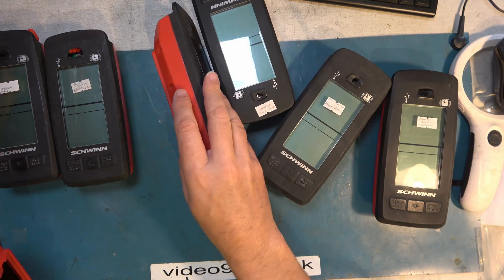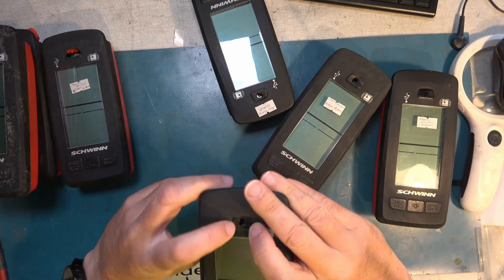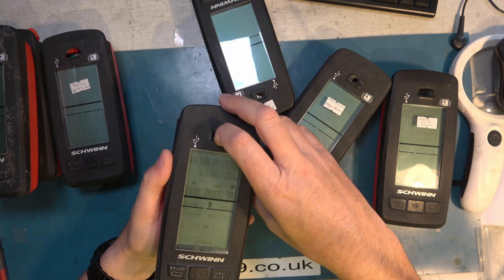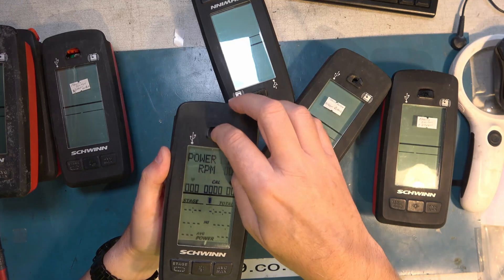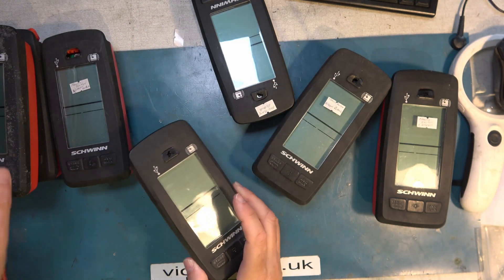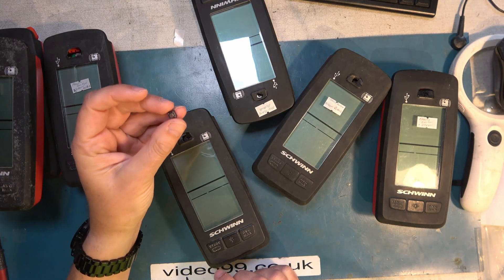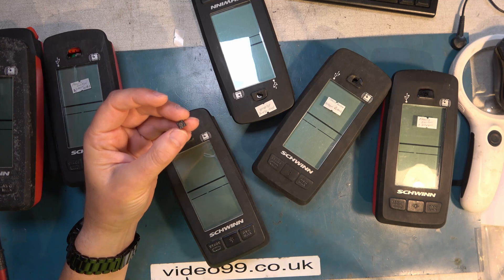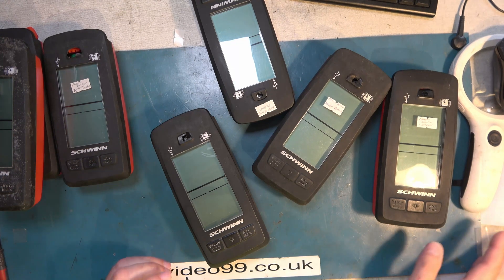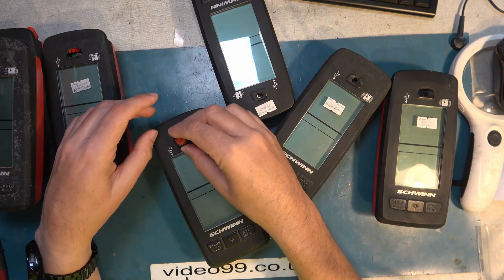One of these has batteries in it. If we go past this broken material here, we'll find a small switch in there. Press it for a moment and that's how it powers up; press it for several seconds and it will power down. On some of these the switch itself is not working. We won't bother just replacing that switch because we really need a whole activator. I've bought in a quantity of these water-resistant switches, and the plan is to mount them in there.